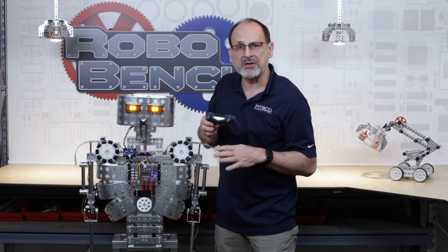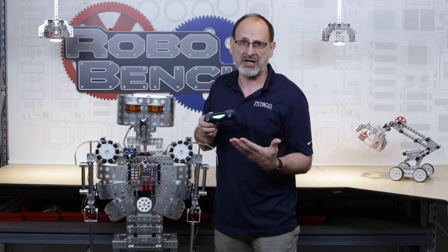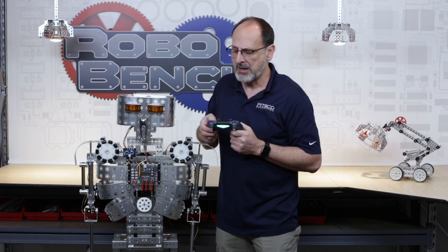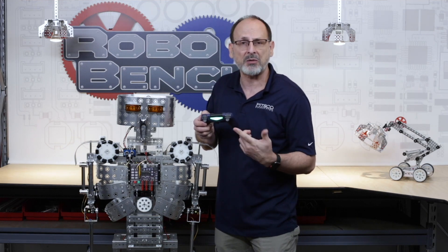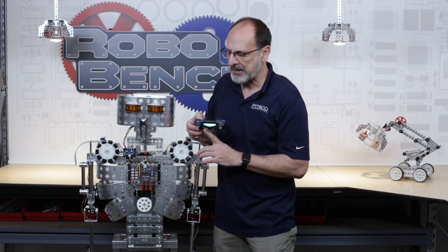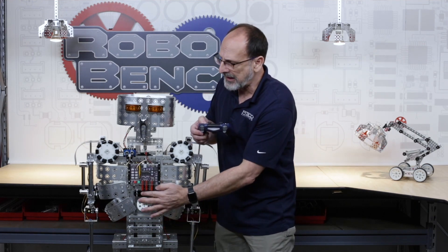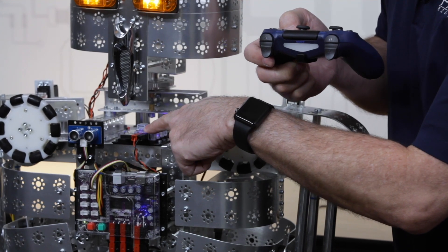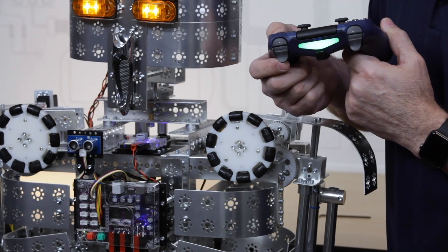Once the controller is in rapid white flash mode, press the black button on the tele-op module one time. It'll momentarily flash red, then you'll get a solid green light on the tele-op and a solid green light on the controller's light bar — the two devices are paired. Once paired, they stay paired. The controller powers down on its own in about 10 seconds, which is typical operation. After it powers down, the re-pairing process is seamless — just power the controller back on and it immediately pairs when you see the green flashing light on the tele-op.